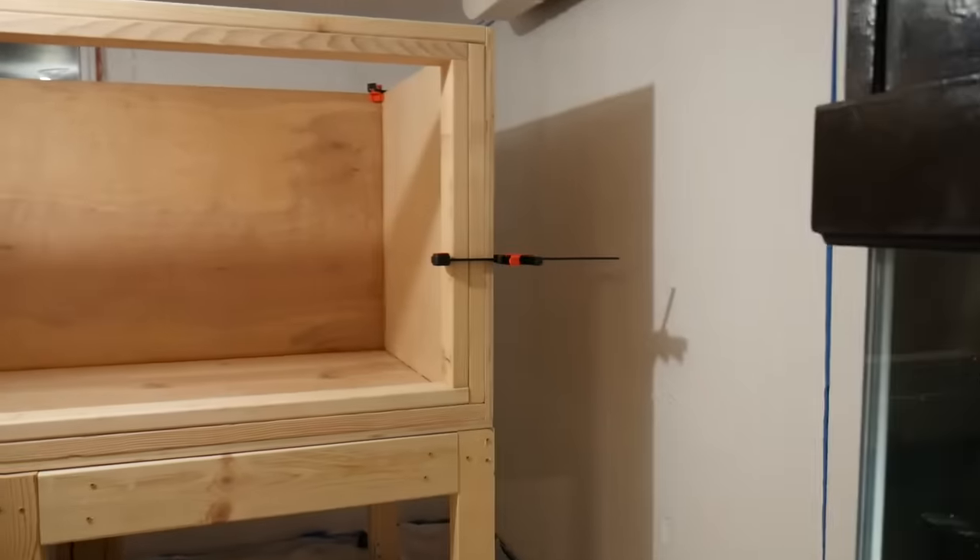I'm very excited to have this stage of the build completed. This was stressing me out a little bit — I'm not super handy with power tools and I've never even used a circular saw before. But cutting the plywood sheets was challenging overall but not too hard. Cutting the 2x4s was really easy with a miter saw, and just getting the measurements correct is the main thing. There is a lot of screwing and gluing in this process. Getting that back panel in place with glue all around the edges and having a tight fit was a challenge. There are a couple of spots of wood glue to sand down, and the couple of screws that poked out in the back panel need to be removed and filled with wood fill before starting fiberglassing, which really reinforces the seams.